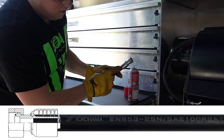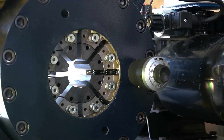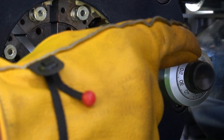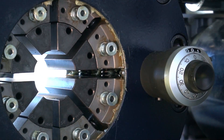Now we have pushed it on to that white line so we know it is pushed all the way home. Now we need to set the micrometer. We have got the 25 dies. When it is set on 0,0 that is 25 mil because there is 25 on the die.